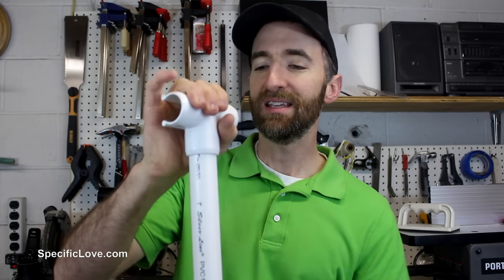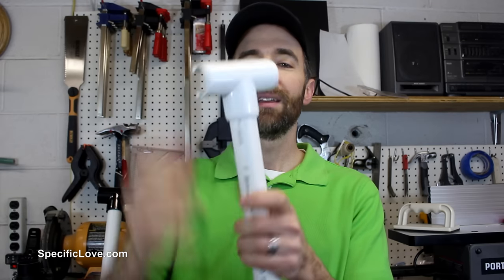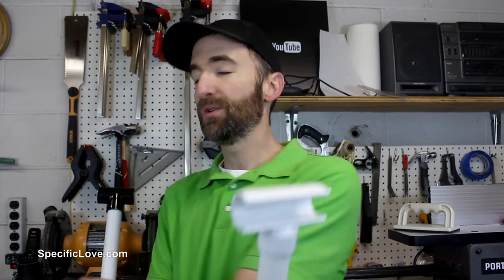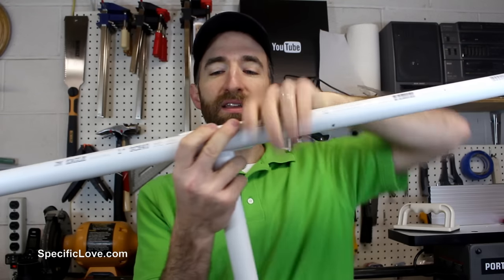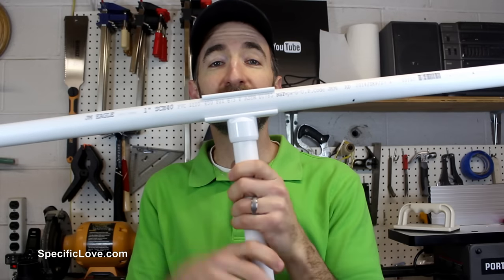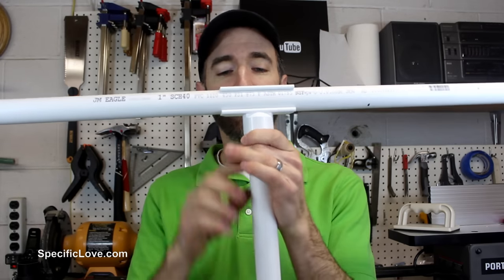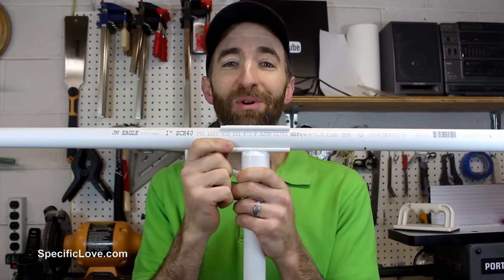All this does is easily saddle on top of another piece of PVC and then it clamps onto the existing pipe. For example, let's say this right here is your structure — you clamp it right over, and now that span that is slightly warped, all you have to do is adjust the length of your support bar and it can easily give it a lot more support.